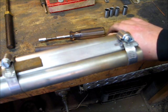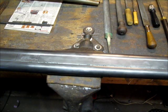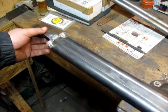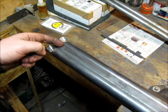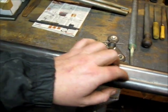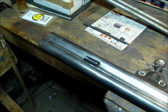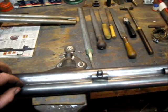I'll heat up the six or so rods I need and start soldering this together. There it is with the ribs soldered on both sides, cleaned up a little to get the flux off. The tang fits on there nicely, though there's a bit of transition work to smooth out here — it's sticking up just a little, and the tang is too, so that all has to be filed down. Then I've got to come in and clean up all the excess solder, but overall it turned out pretty decent. Flipping it over, you can see the pipes and rib on the bottom side — that side will also have to be cleaned up next week.